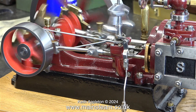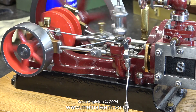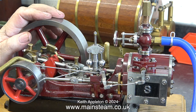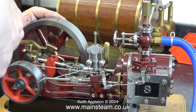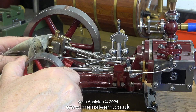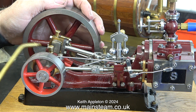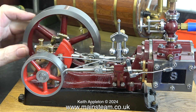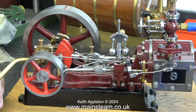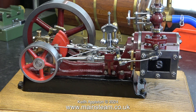As you can clearly hear, the beats of the engine are far better than they were before I shortened the valve. It's not as jerky and it's much better at slow running. I think it's time to give the engine a thorough oiling. The lubricating oil is starting to run clear in more parts of the engine, though it's still a little bit black around the connecting rod.